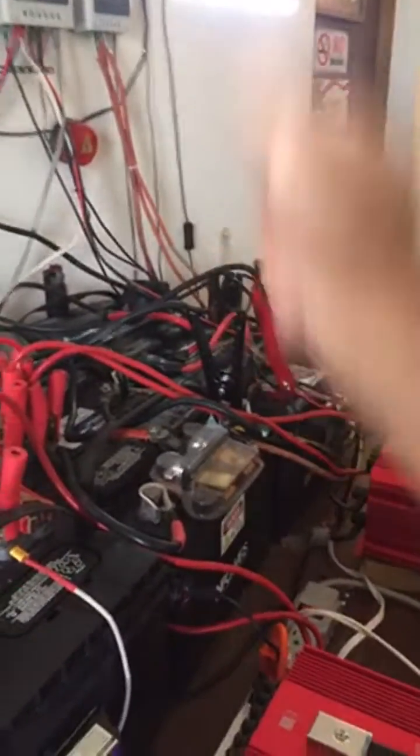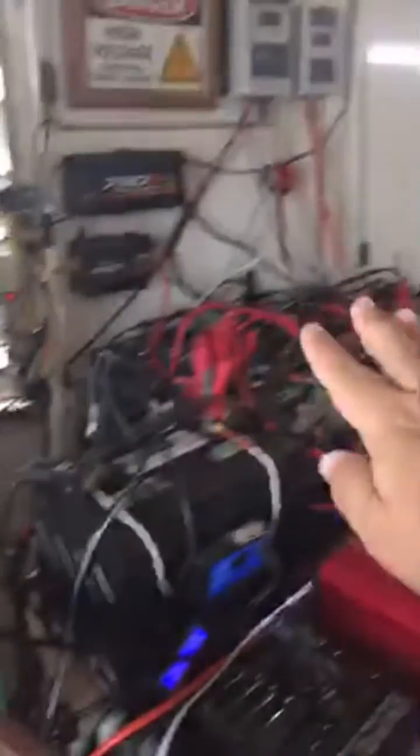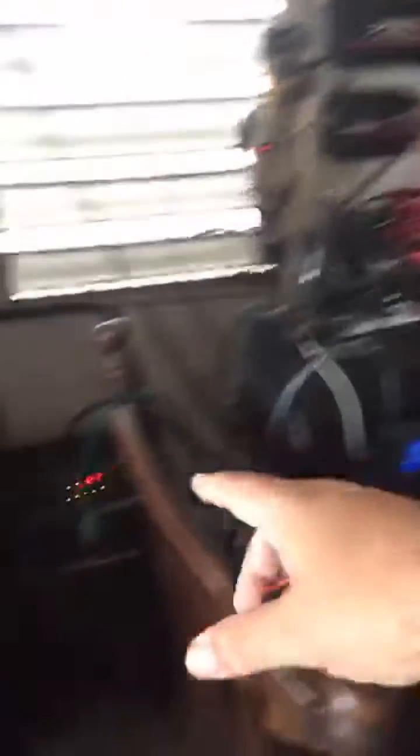This is a big no-no: once you have your charger hooked up and your generator running, if you disconnect your charger all of a sudden there's going to be a surge spike — your generator is gonna surge up to 180 volts and that surge will come right back and burn out your charger. Once you have this running you don't want to touch it. Don't turn off the generator when it's putting out 20 or 30 amps — that's a disaster. Your charger will burn up.